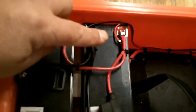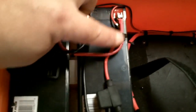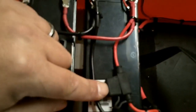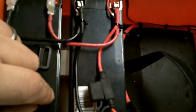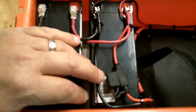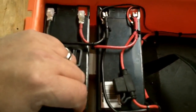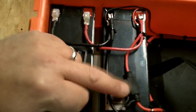I've come off of battery two with my power leads. The power lead runs down the side of the box over here to the lid. I've got a 15-amp blade-type fuse inline — you can pick that up at NAPA or any automotive store. That's not necessarily required just for the depth finder, but for that 12-volt socket, if you're running a spotlight or something that might draw more amperage, it's a good idea to fuse this.